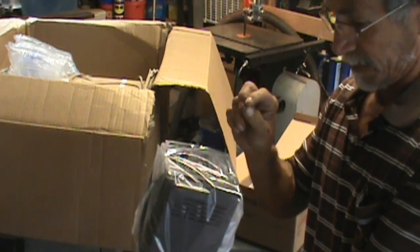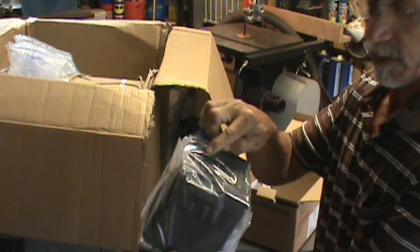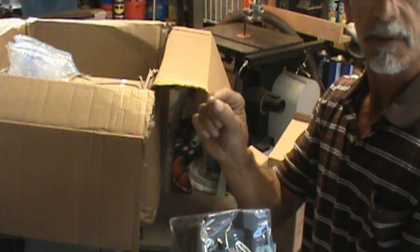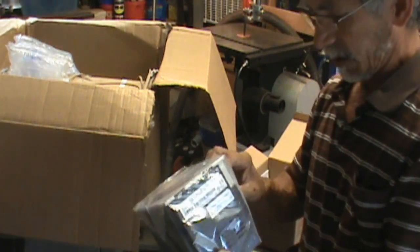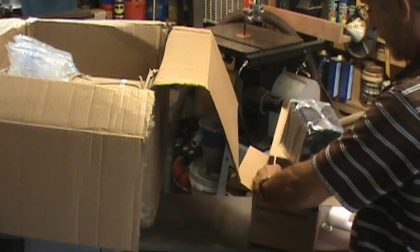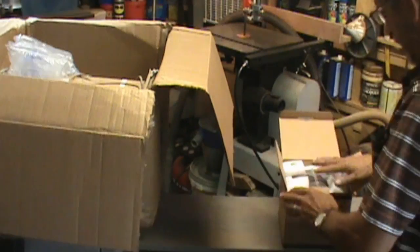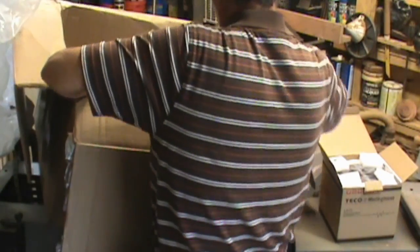override speedometer, tachometer, variable speed controller, so I'm not using these buttons specifically. I will override this. Get my forward and reverse functions from a separate switch, again, rather than through the parameters on this. And we'll take it a little bit into detail on what's there. So here's the VFD. It does come with a booklet with some instructions and all the parameters that you need. And I'm going to put this box down so I can handle this motor.